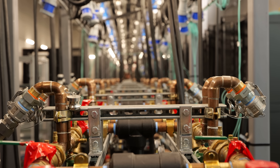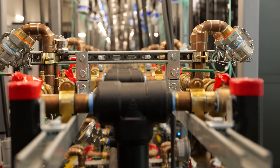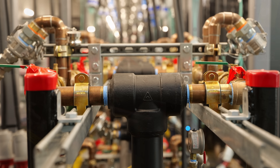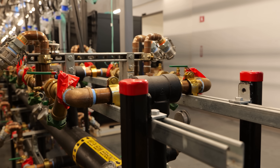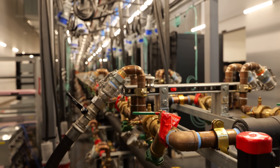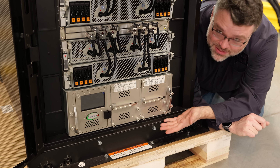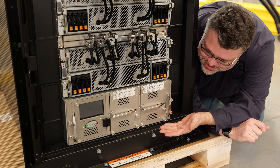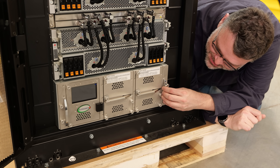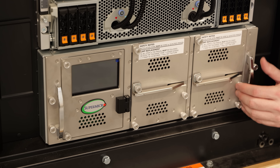This is the cooling aisle data center future. All of this plumbing and piping brings cool water in — and cool is relative here, it's 32 degrees C ideally. That's plenty cold enough to remove all of the heat from all of the racks connected to this. This piping connects to the heat exchanger manifold in the bottom of the rack. The fluid in this pipe never actually touches any of the heat sinks inside the rack; the manifold distributes the cool PG-25 throughout the rest of the rack.